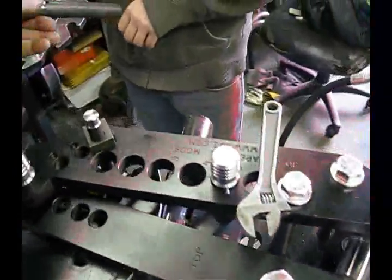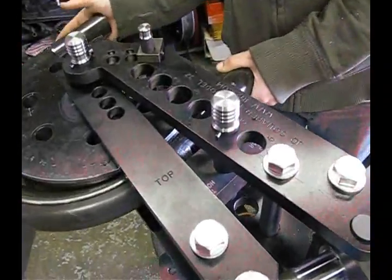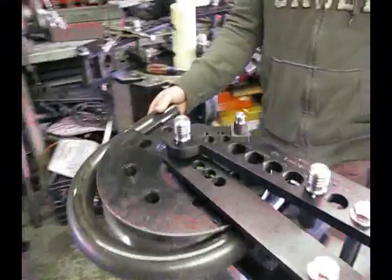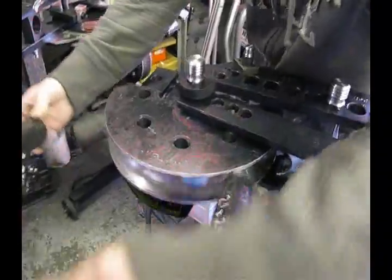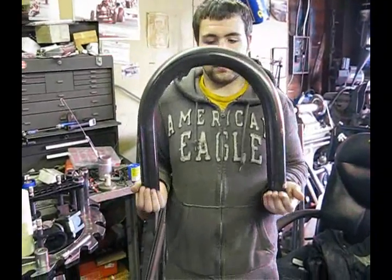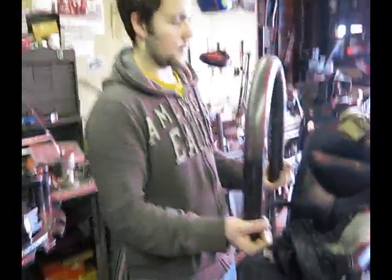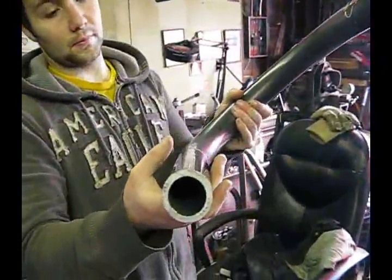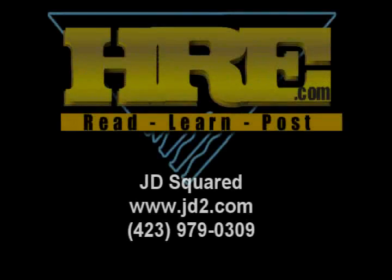We'll take this and hand that off. We should be able to knock this thing out with a hammer. Oh, look at that — you don't even need to knock it out with a hammer, that's unbelievable. I've seen benders where you bend tubing not even this big and struggle. And there you go: 180 degrees, perfect. Two inch, 250 wall — just astounding. Let's turn that thing over and see that wall thickness. This is an amazing, amazing machine.